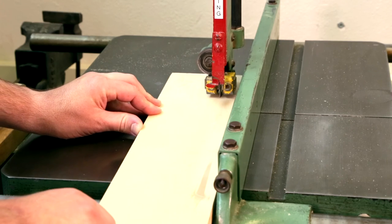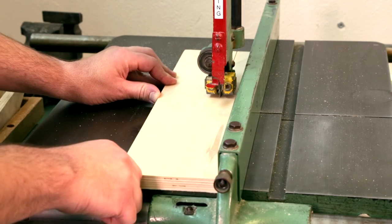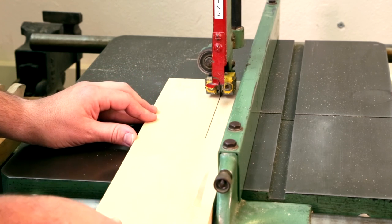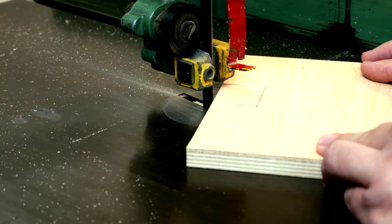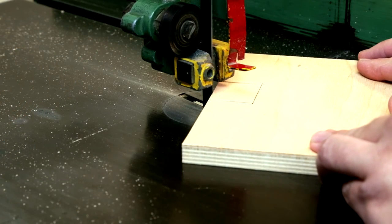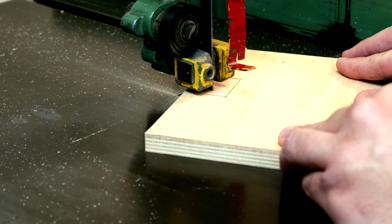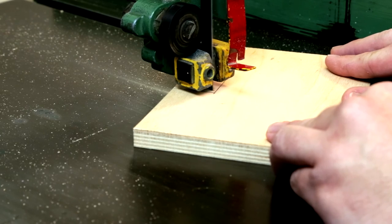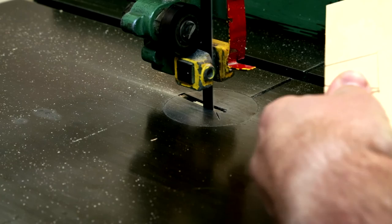When making long cuts that do not extend to the opposite edge, back out the material straight without twisting the blade. When cutting interior notches, material must be removed to provide clearance for the blade to reach the back of the notch. Here, we use a V-cutting strategy to remove the material in small pieces without twisting the blade.